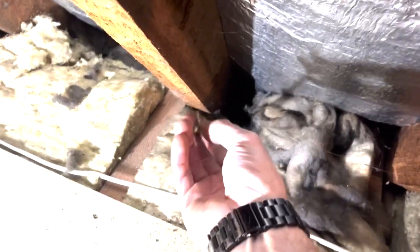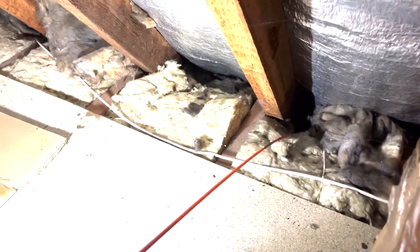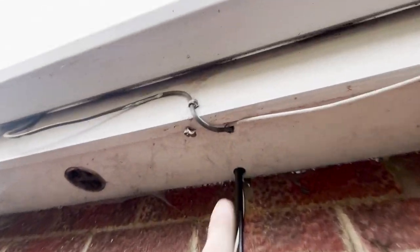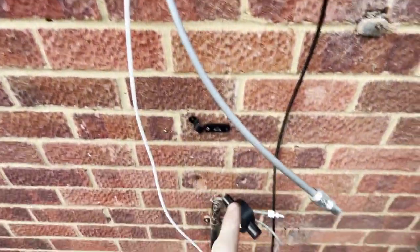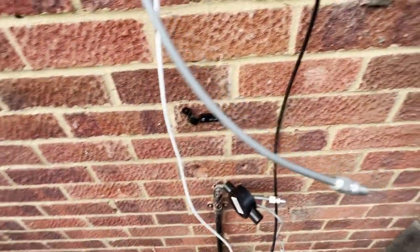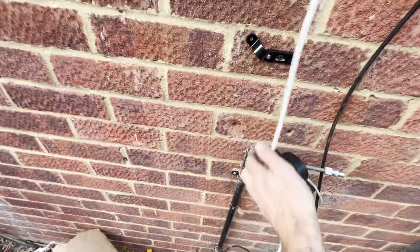Success — the rod is here and we're going to give that a tug and hopefully get the cable coming up without any snags. The Cat6 is in, and to tidy up the coax and the Cat5 I've drilled a hole and pulled it back through ready to go into the conduit. I've put conduit clips down and put heads on the aerial cable — I had to cut that to enable me to put it into the conduit.